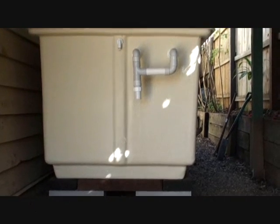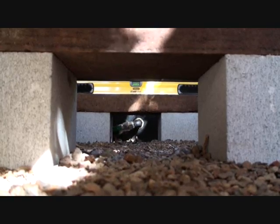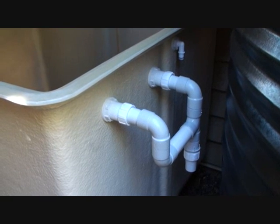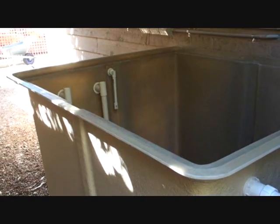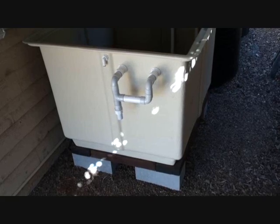After I was happy that all of the blocks were fine and the sleepers were all good, I then raked the pebbles back up against the blocks so that they covered the crusher dust and gave a little support to the blocks. After the tank is filled there will be over a tonne of weight pushing down, so those blocks won't be moving anywhere. So that's it for the fish tank base. I hope this has been useful and if you have any questions ask away. See ya!